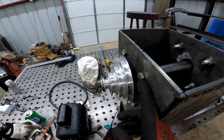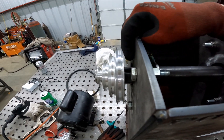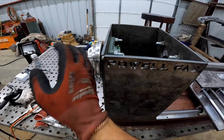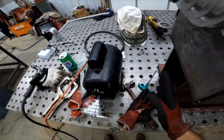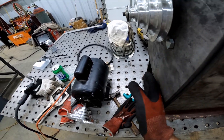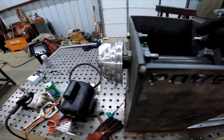So right here, whenever I put this pillow block in, I was going to space it back here so that there was more area that the bearings actually covered on that shaft. But I got to thinking about it — when the motor and the pulleys are mounted, I want it to be as close and as flush to this housing, or the base, as I can. So I went ahead and put it on the inside.